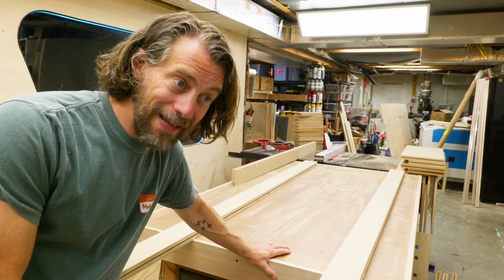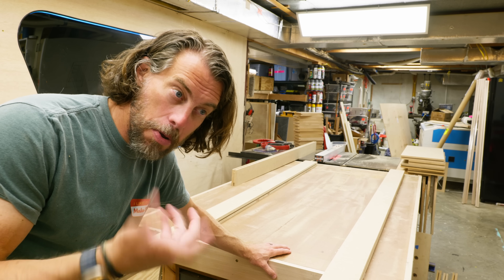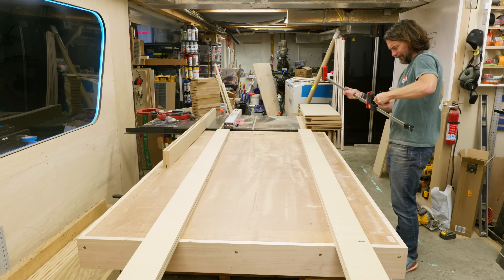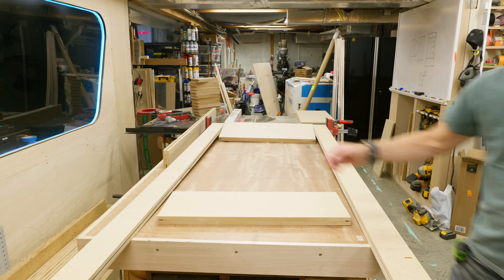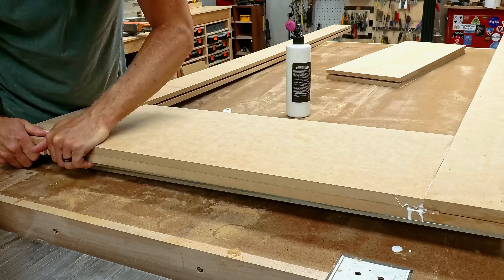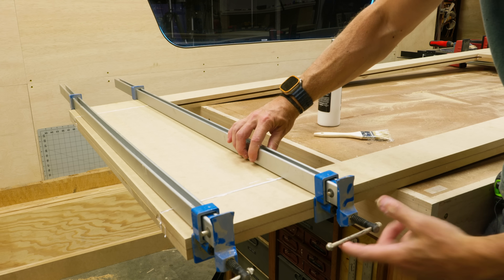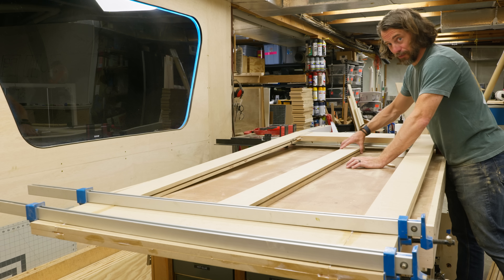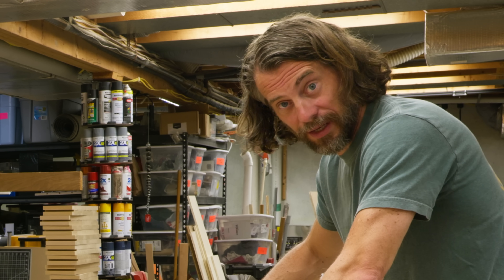Until this moment, I hadn't really thought about how to assemble this — like how to clamp up the entire door. I think it probably makes the most sense to use a big clamp and clamp together the four outside pieces, because then I can focus on just the clamping pressure across the top and the bottom, and then once I've got that frame, everything on the inside should kind of be automatically clamped. I'm just now realizing that I did not put a slot on the bottom for the centerpiece to go in, so that's just going to be glued and clamped in some crazy way that I haven't figured out yet.